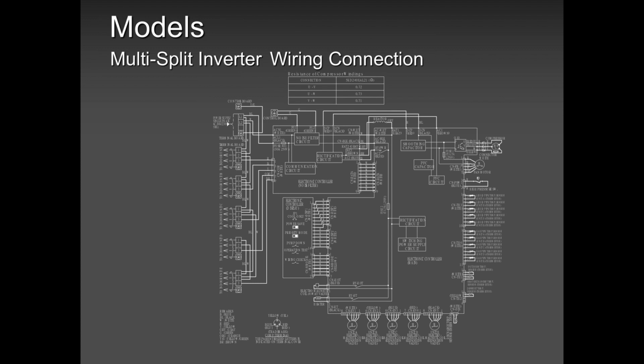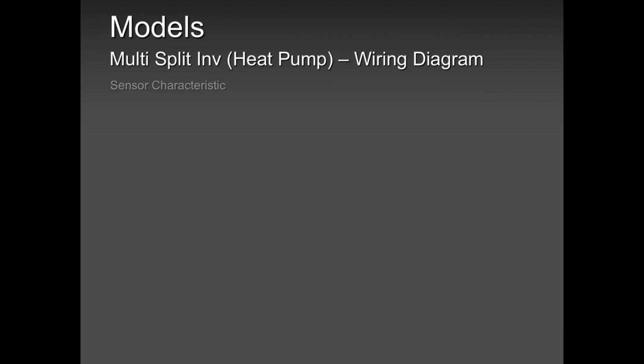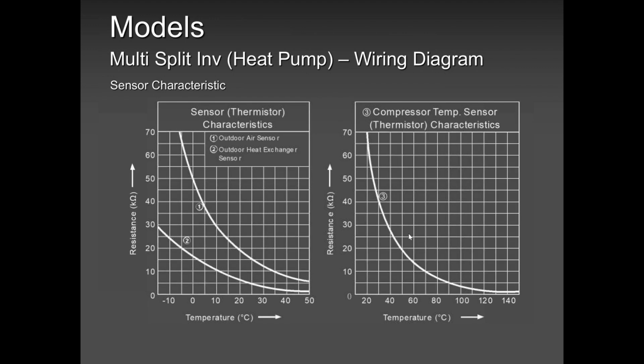That's your wiring. A to A, B to B, C to C. You will never have issues. So please keep that in mind. Multi-zones, the only calls I get, guys, so far is cross wiring. Our manual, our app has all this information. All this information that I'm talking about, it's all on our app.